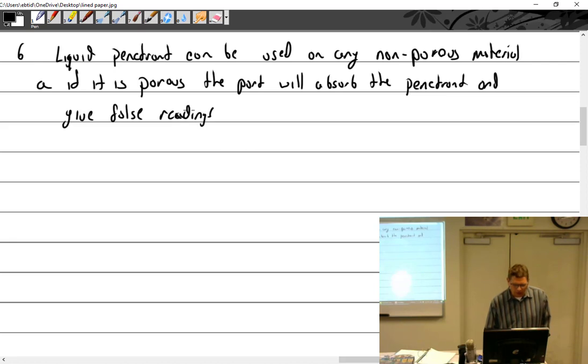Kevin, this piece of wood is so cracked. It's unbelievable. That means don't do that, Christian. Have you ever taken a piece of wood and gone through the whole process and looked at it under the black light just to see? No. But you know that table in the classroom that we're working on? You should peel up the bevel and see what it looks like underneath that. Pretty bad. Well, yes, because what people used to do is they would take butcher block paper and lay it down on the wood table and do their penetrant inspection. So what did the penetrant do? Went through the paper into the wood. Had to hit the paper, spread out, then went in the wood. So little drops became big drops. So that's why I got the metal and put it on top of there.